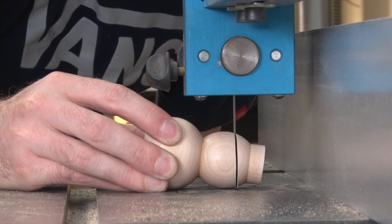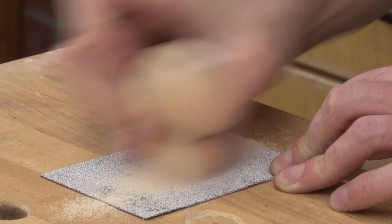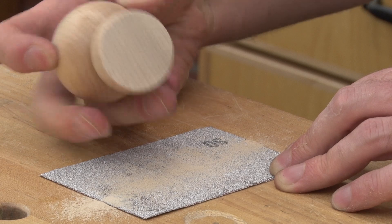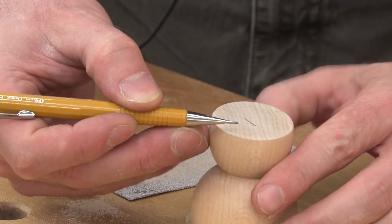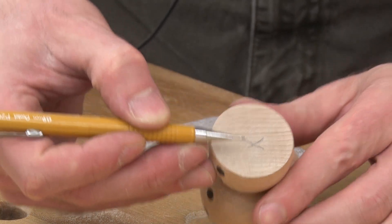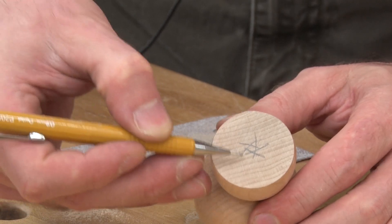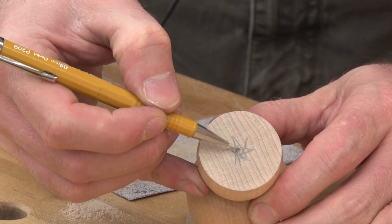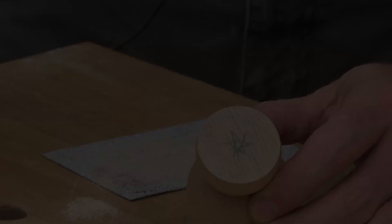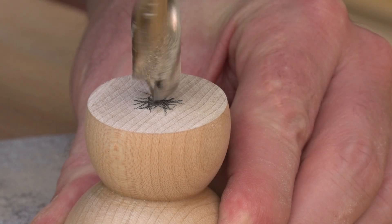Caution is used to ensure my fingers stay away from the blade. I remove the bandsaw marks using sandpaper on a flat surface. Using my finger as a stop on my pencil, I create lines that are equal distance from the edge of the head, working all the way around to find the center point. Using my dividers, I mark a starter hole for the drill bit. Using a half inch drill bit, I drill a half inch deep hole perpendicular to the top of the head.